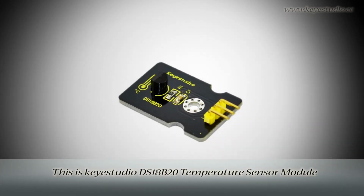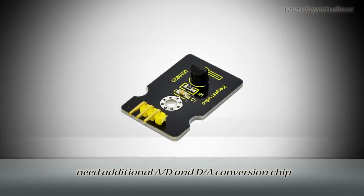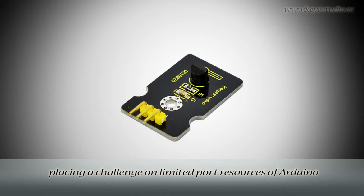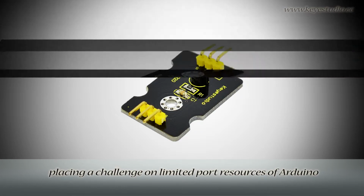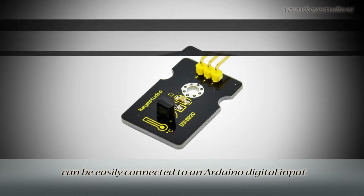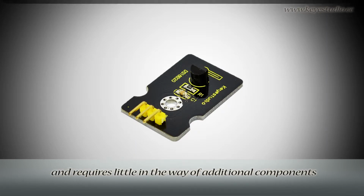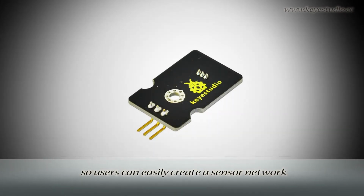This is the Keyestudio DS18B20 temperature sensor module. Unlike traditional analog temperature sensors that need additional AD and DA conversion chips, placing a challenge on limited port resources of Arduino, this newly developed DS18B20 temperature sensor can be easily connected to an Arduino digital input. The sensor communicates over a one-wire bus and requires little in the way of additional components, so users can easily create a sensor network.